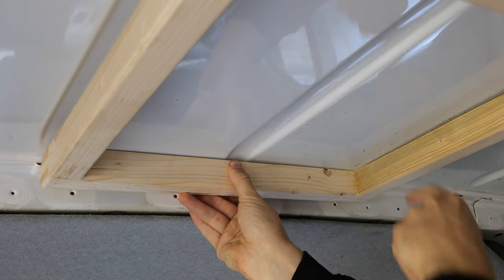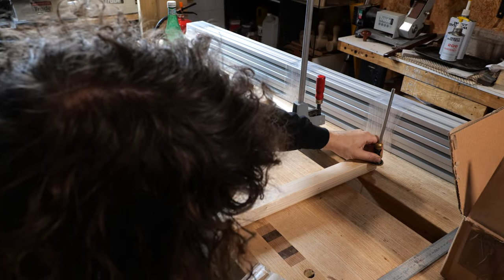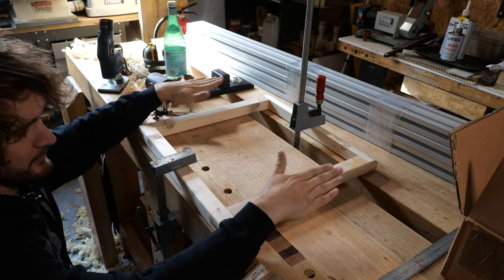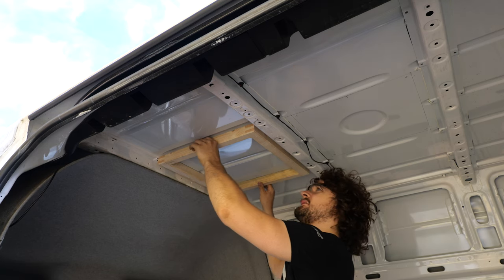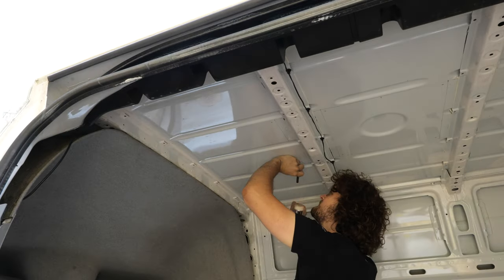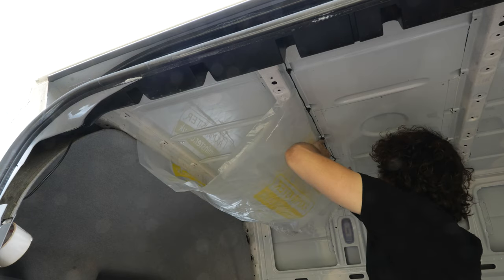With both internal corners sitting flat, I planed the curvature into the frame — dipping the corners back about two to three millimeters to close up the gap in the middle. I scribed a marking gauge line at 3mm from the top and planed back to it. It came out lovely. Interestingly, you can see a skylight was already marked out on the roof — I nearly put this one in the wrong place, which would have prevented me fitting all the solar panels I'd already purchased. A very near miss; always worth quintuple-checking.